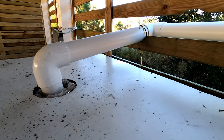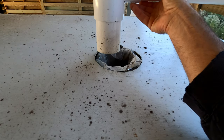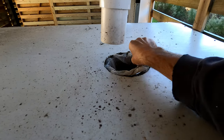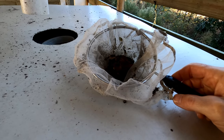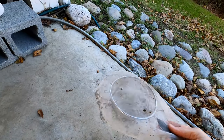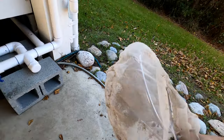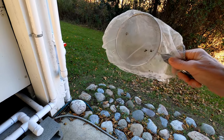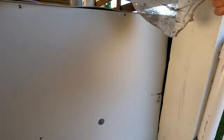For the filtering right at the tote, we have an elbow coming in at a slight pitch into the top of the tote. This is why it's good not to glue anything — you can easily move things around. I have a simple filtering mechanism down here. I'll take it out — there are actually some leaves in there, but really that's from fall leaves blowing around the yard. Every couple of weeks I come out, tap it out, maybe rinse it a bit. It's a simple dollar store strainer with a paint filter wrapped around it for a little extra protection, then I pop it right back in.